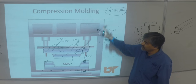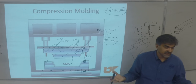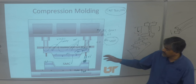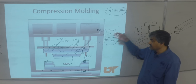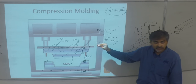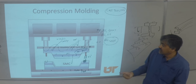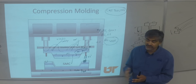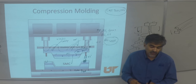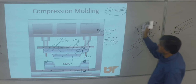For large parts, it's very economical to do cast tooling as opposed to machined tooling. For a complex part like a bus roof, trying to machine the tool from metal would be exaggerated in cost, but if you can cast in your lines in a sand-cast mold and pour your metal, you can build it at almost a third of the cost. Cast tooling is very common in the industry — everything is rough except the contact surfaces, which are just machined.